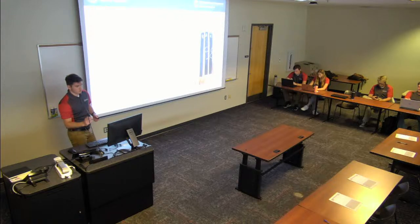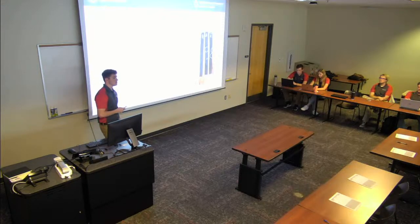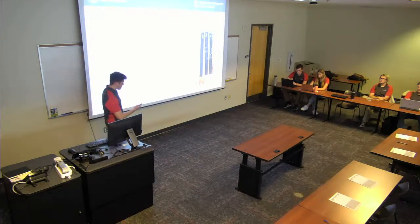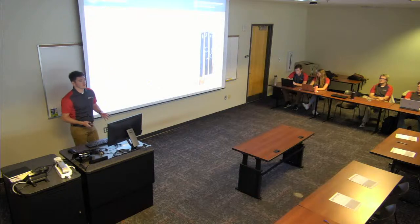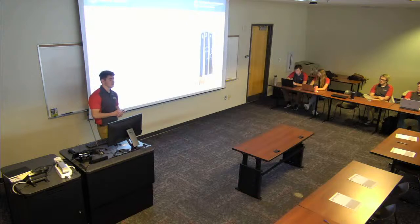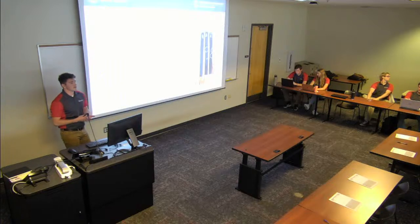So moving on to talk about the tensile testing. We created test coupons, and we're using the ASTM D3039. That's just a standard for testing composite material. And you can see them over here on the right. They're slightly bowed, so we are actually remaking them so that we can have a uniform cross section, because if we're going to do the test, we want good data. So we are making those again right now, and we will be testing both a plain and a 2x2 twill